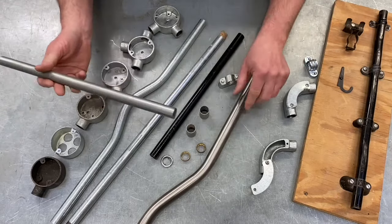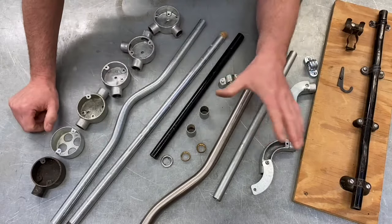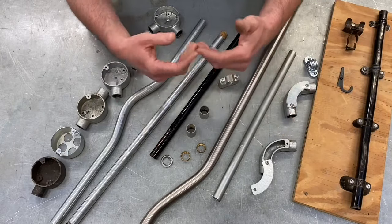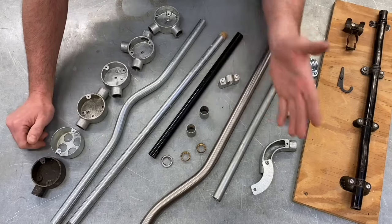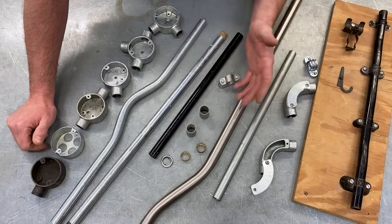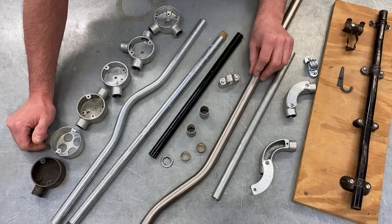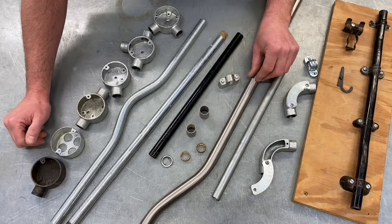Conduit lengths: stainless steel, black enamel, and zinc galvanized all come in a standard length. It used to be that steel conduit was the exception to the rule - a full length used to be 3.75 meters, old 12 foot. As time has evolved, electricians said they couldn't get those lengths in the tubes on top of their vans, so the full length has been reduced to three meters. Be careful - some exam questions still reference 3.75 meters, so just be aware a full length of steel conduit is probably now three meters from electrical wholesalers but used to be 3.75 meters.